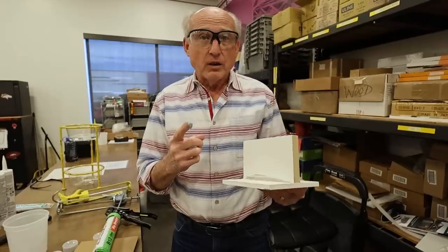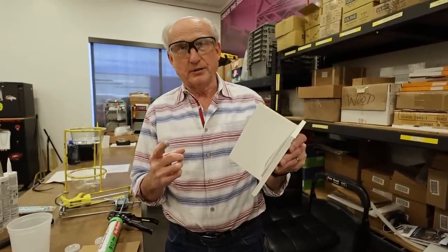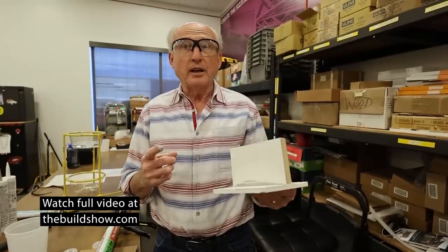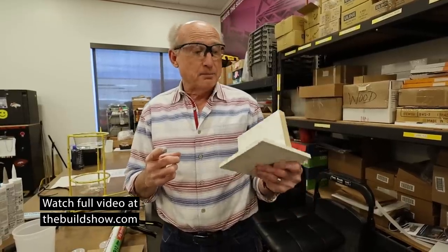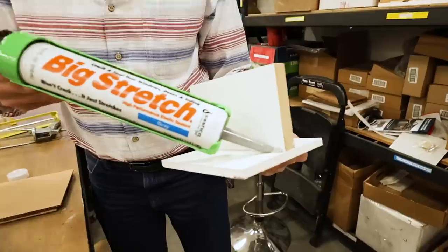Yep. And so our message to contractors is, no more micro beads. I love it, Les. When we come on the job site, we want to see a minimum quarter inch, but preferably a 3/8 inch. And that pertains to whether you're going around a window or even a bathtub. Yep. So no more micro beads. Let's get the performance this product was made for.